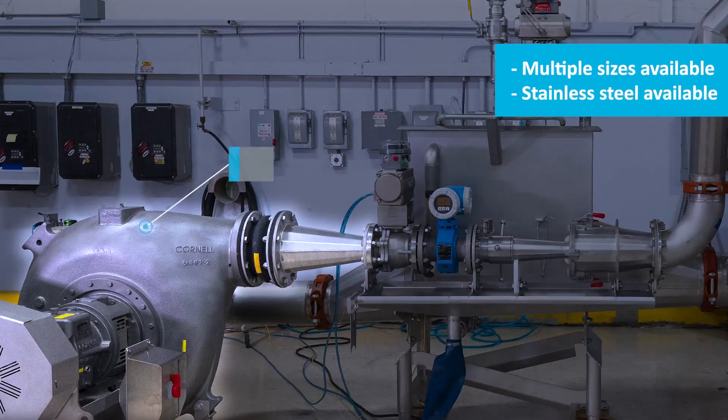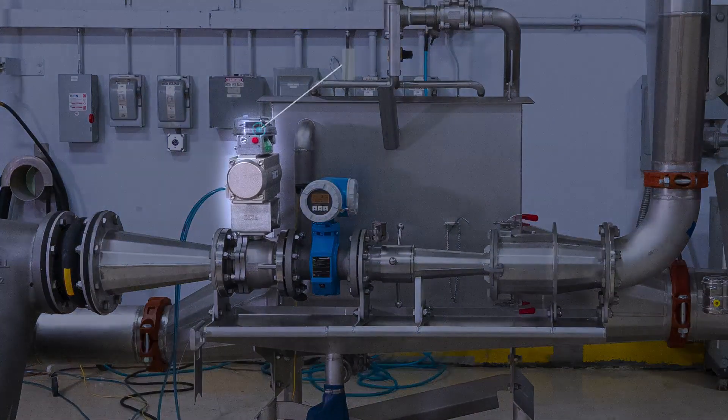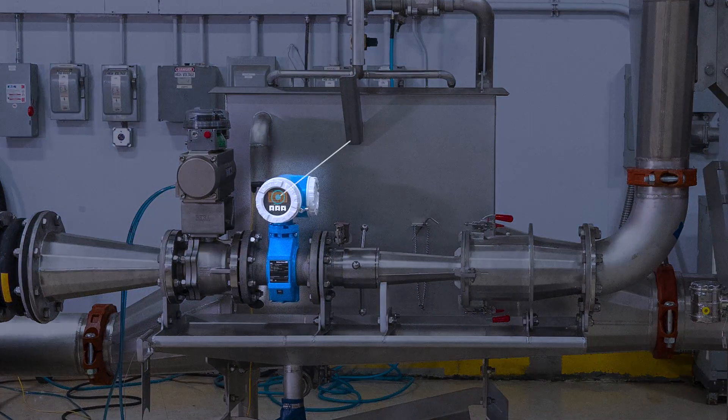Then it goes through our food handling pump, available in various sizes depending on product size and requirements. Then we have a ball valve that helps isolate the hydro tube portion so you don't lose excess water during tube changeouts. Then we have our flow meter, and that in conjunction with the hydro tube size will give us our cut speed, which we try to maintain in a real specific window for optimal cut quality.